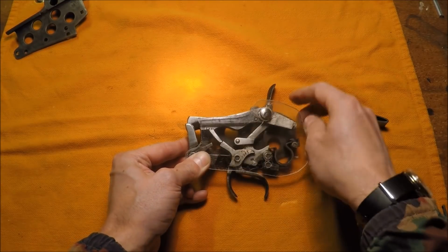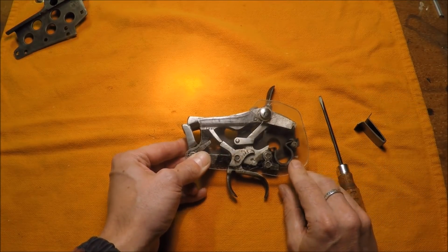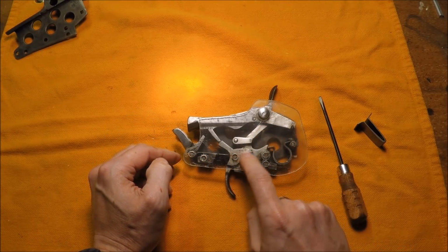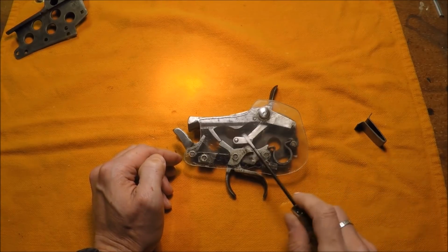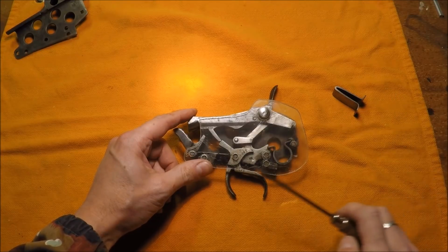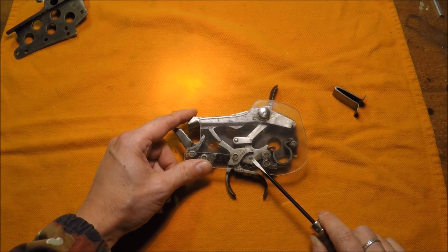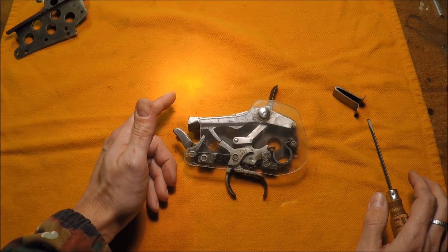Okay, obviously here the block wobbled a bit because it doesn't have this spring to hold it in place. But the most important thing, notice, is that the striker moved, but the front trigger here and locking arm didn't. That's because it's locked in position due to the pressure from the breech block, obviously with the spring in place here, and therefore it doesn't move when the stud here drops as the striker rotates. So that's the fired position, and all that leaves is to drop the breech.